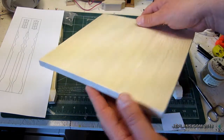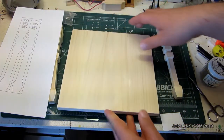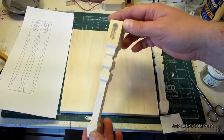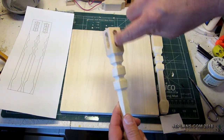The tabletop is going to be basically 8 and a half inches square. These are the legs I'm making. I'm going to show how to make the leg. This is the current design — basically I'm drilling 3 holes and then chiseling it out.